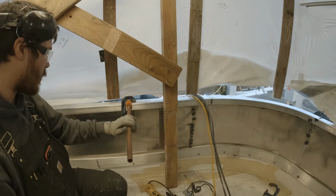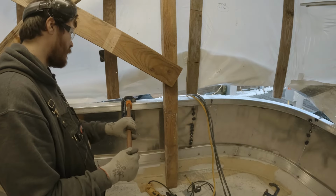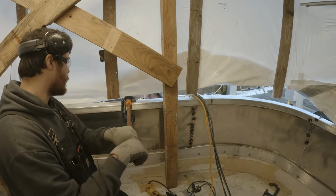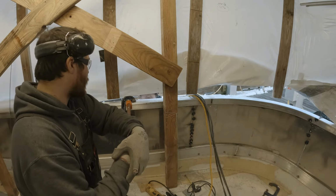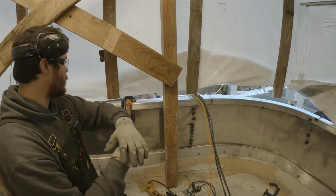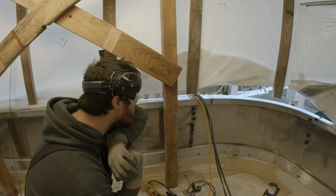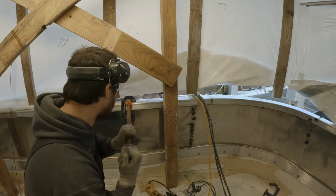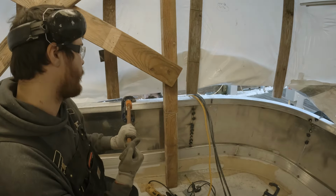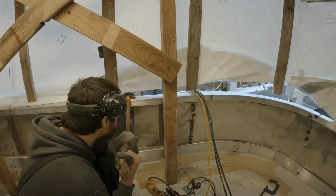Okay, so I just got a bar clamp on the cap rail here, a C clamp to hold it on. I go up or down, don't slide off, and apply a little downward pressure so that as he welds on that side, it doesn't tilt the rail out. Ready when you are. It shouldn't move a whole lot. Because of that corner, down here it'll still twist this piece. Ready.